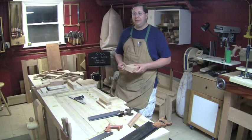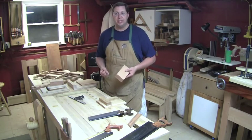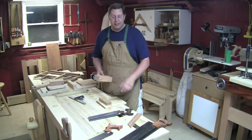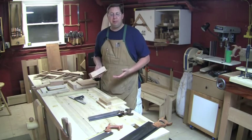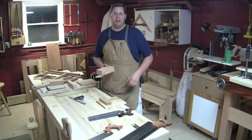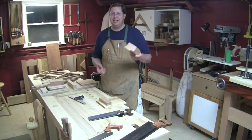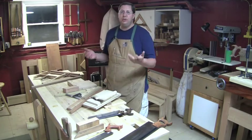It's really up to you how you tackle that, but you don't want to jump into that the first time on a really important furniture project. Use your firewood scraps to test out those compound cuts and just get used to the motion of cutting compound cuts, cutting miter cuts, cutting square cuts. It's so much body muscle memory. After a couple of practice runs, you'll find this is easy stuff and I don't even need that miter box saw anymore. And you might find yourself not turning to the bandsaw or the chop saw all that much anymore. And as I keep saying, you burn a few calories along the way and Lord knows I could use it.